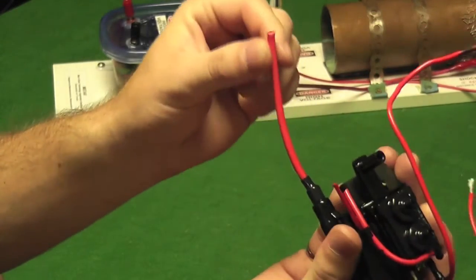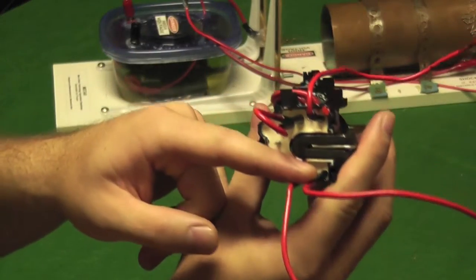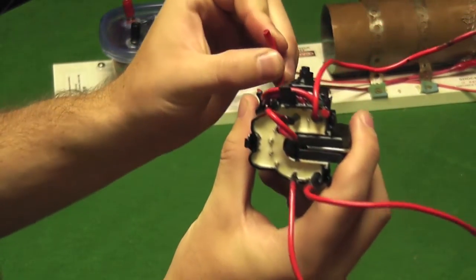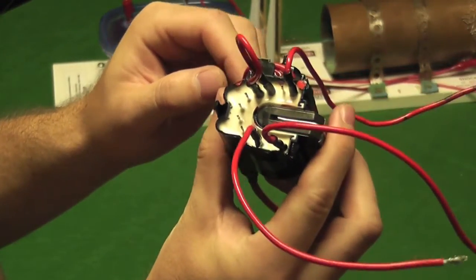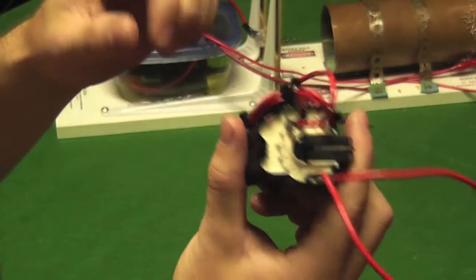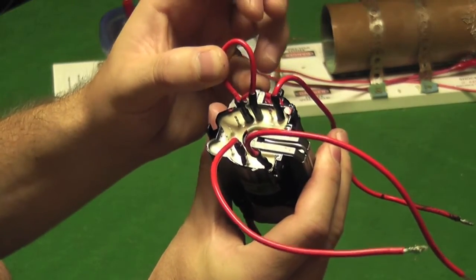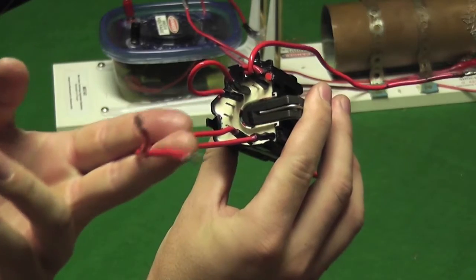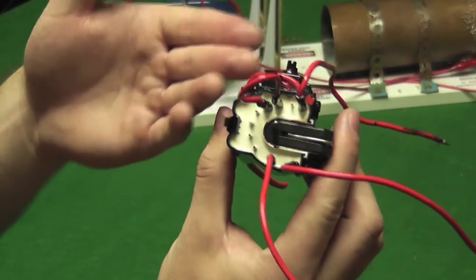This is your high voltage out — the big thick cable coming off the top. To find your high voltage ground, you'd basically do the same: send some kind of small electrical signal through the transformer in reverse and read which one of these pins would be at zero. On most flyback transformers, the ground is going to be this one right here at the top right. It doesn't really matter which one is hot or neutral going into the primary coil.